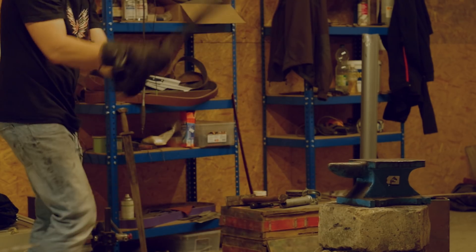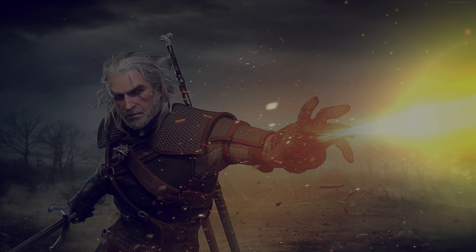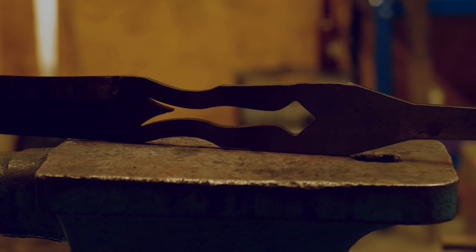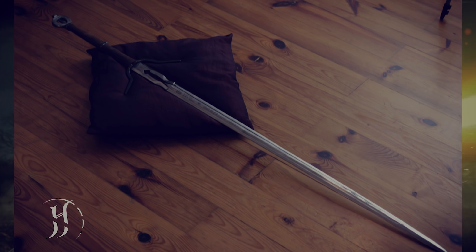What about its durability though? Is the blade prone to explosive shattering, as some would claim? Not really. Sword strikes are never as hard as slamming the blade against an anvil — and I did that about 10 times in a row, to no effect, apart from the edge getting some dents, of course. I also tried hitting the cutaway part from the side with a 3-kilo hammer. There was a bit of deformation, naturally, but no cracking. It is also worth noting that this blade was not heat-treated prior to these tests — a hardened and tempered one would likely show much less deformation from being compressed against an anvil. So yeah, a sword like that would be less durable than without the cutaway, sure. Would it matter in a fight? Not really. Do bear in mind that a situation where two blades slam into each other at full power is extremely rare in sharp-on-sharp combat. Most fencing is done with much less destructive force, rather relying on the sharpness of the edge and the point.